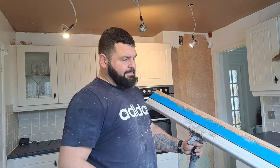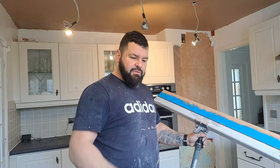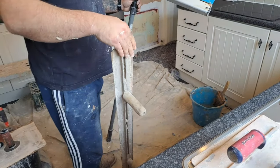These are excellent for flattening in when your plaster's on fairly thin. They're great for flattening in, but they're not good for getting things straight. If you want to get things straightened out, you need to use something rigid. Now you can use a Darby or a feather edge.